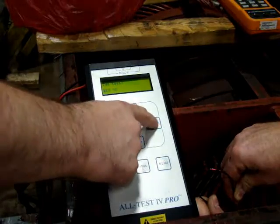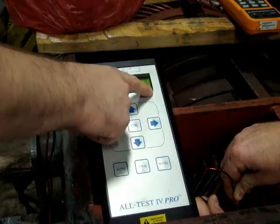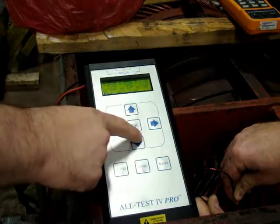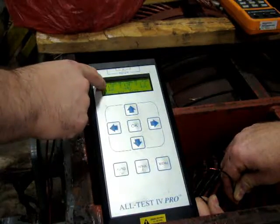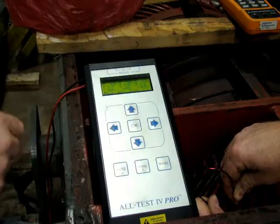Now with the short, we got 214, 198, 213 impedance; 88, 87, and 88 degrees phase angle — a change of one digit. Inductance is 42, 39, 42 millihenries, and 49 straight across for current frequency.